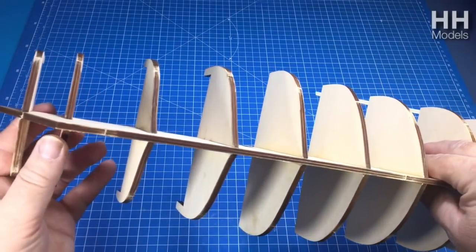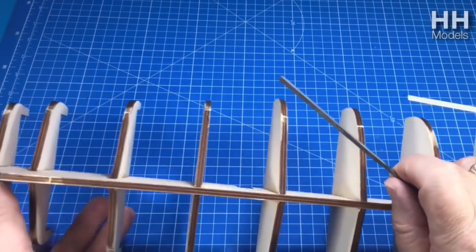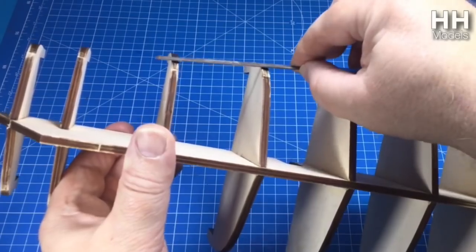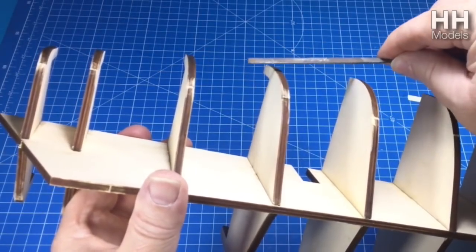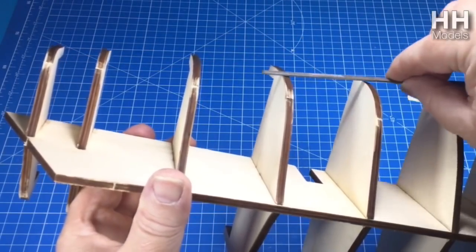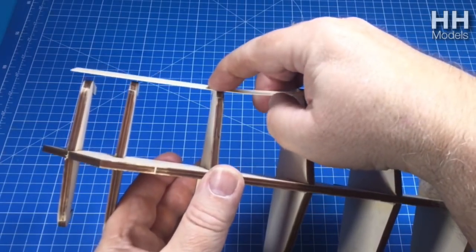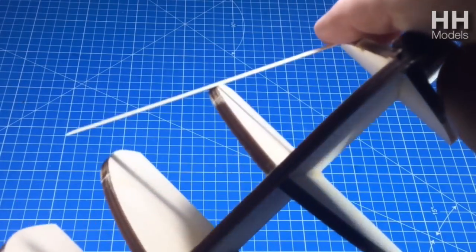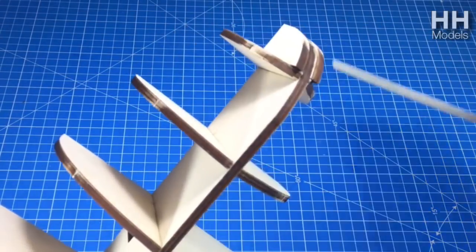What you've got to do is called 'fairing the frame.' You get your file — even a small one works — and you lay it across the formers. You can see straight away that you've got high points and low points, and you simply file until you take those ridges off. Don't go further than the middle — just take a little bit off each one, because each former requires a slightly different angle. Come back with the plank and check: you should end up with it perfectly flat no matter where the plank is sitting. I cannot emphasise that enough, especially at the bow — there's no way that plank is sitting on that correctly without fairing.